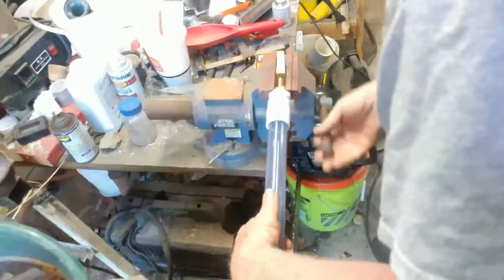That's why leaches get recycled, because they do have a little gold in them even when they're completely done. Pass them through again, you reuse them. The idea with this leach is pass it through the carbon, and then this leach goes back to the beginning. Goes back to the leach tank. We add more ore, recharge the leach with Eco Goldex, and we're good to start over again.